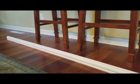A lot of times wood, when it absorbs moisture, can start to bow a little bit. One of the tests you can do on the floor of your Home Depot or Lowe's is this: set it down on the floor and look for gaps. If every part of that wood touches the floor and nothing's bowing, bending, or risen, then you have a very nice square piece of wood. As you can see, mine comes up just a little bit right here, but not even a quarter of an inch. Then another thing to check: lay it down flat and see if it touches the floor — over here we have a lot of play, so it's bowed in this corner.